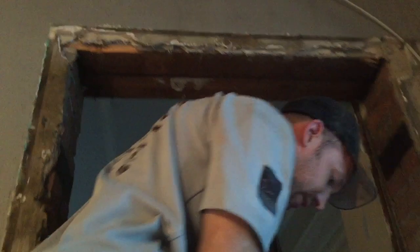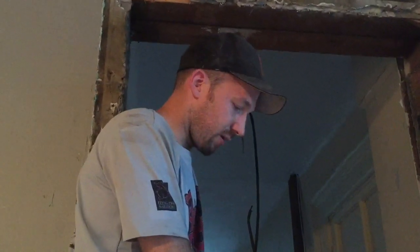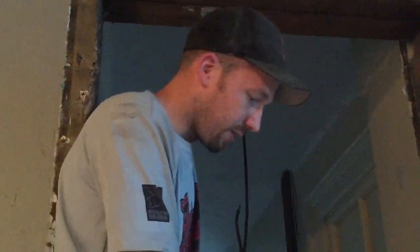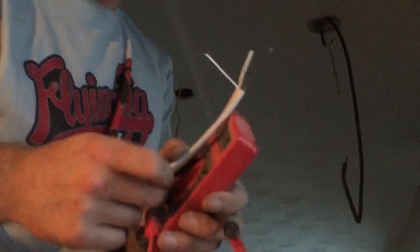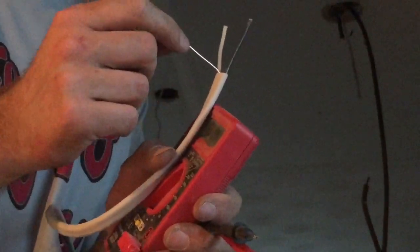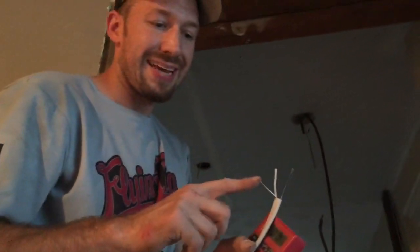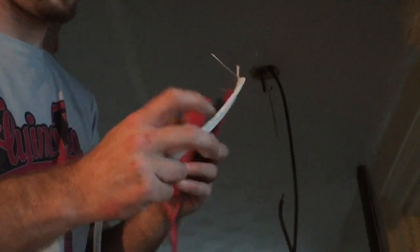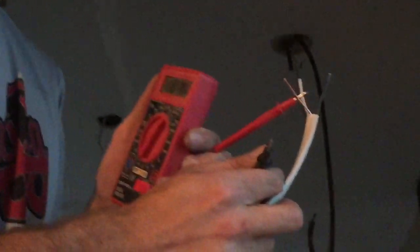So I read a forum and here's what they said to do. Take some cable and run it down to your copper pipe — that's where the neutral is grounded for your whole circuit breaker. So I've taken a section of 14-2 wire and took the copper ground, secured it to the pipe downstairs — our water main. Then I'm going to connect this wire to one of these sides on the multimeter, which is going to give me my neutral reference.